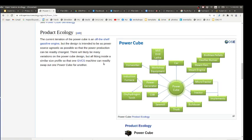So that's actually a problem. The micro track right now is running without a fan, so you can only run it for so long before it overheats. You have to add a PV panel or something, or a different engine. They have 18 horsepower engines that have good charging, but those particular ones only have a couple of amps charging.